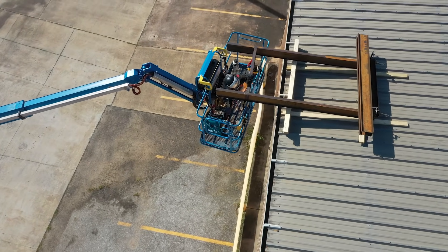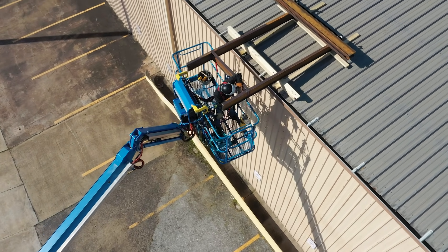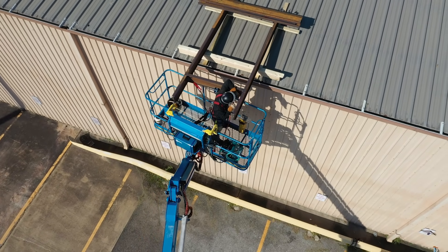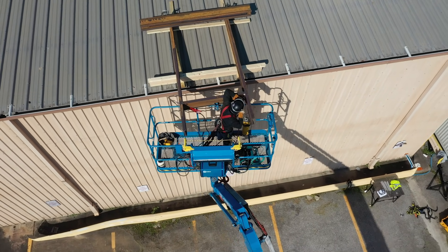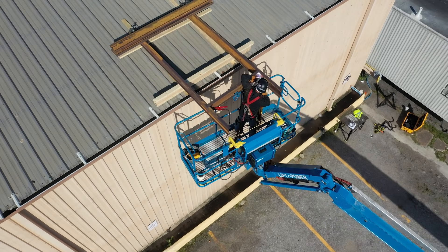A great thing about the XC Genie: it has a 12 kilowatt system. It does 100% duty cycle for TIG and stick welding, and 55% duty cycle for flux core and arc welding at 280 amps and 360 amps. You really can't beat that.